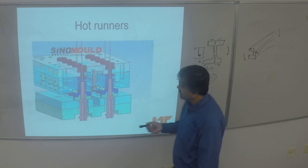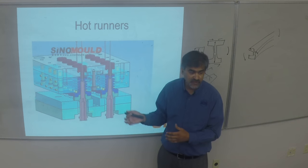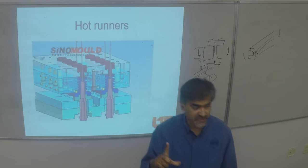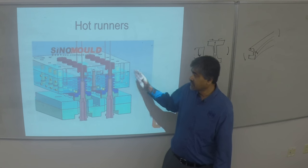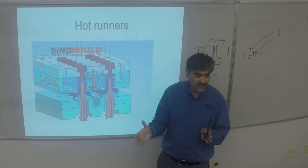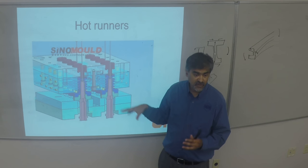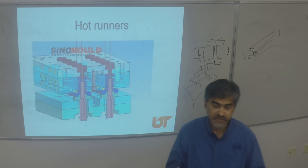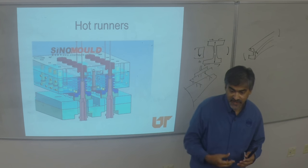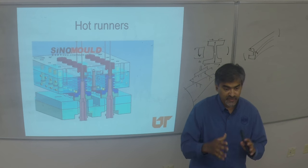The Autodesk software I'll go over in the next class — as long as you have your part design made, the software will fully assemble the tool for you, including ejector locations. All you have to give is the diameter of the ejectors, their length, and certain basic geometry, and the tool base is sized for you based on the part itself — how much the length and height of the tool should be, what is the volume, and so on.